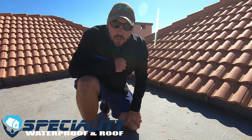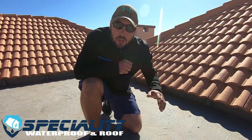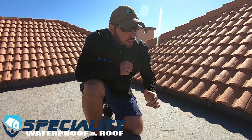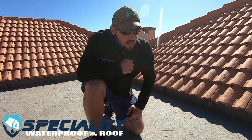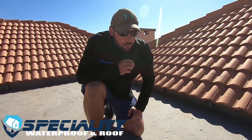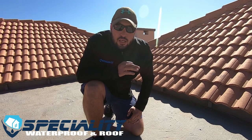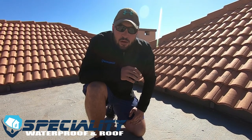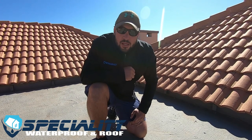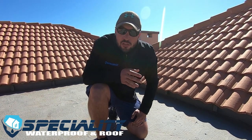The customer has already had to repaint after this system was applied. Now we're going to be doing a torch-on system on this. We're going to clean the surface, apply a primer for adhesion and cohesion purposes, then torch a formal membrane system on this and apply a silver coating to reflect UVA and UVB rays. The system is protected for at least three years maintenance-free, but the product is guaranteed for 10 years. After three years they'll apply a maintenance coating, so this system should last anywhere from 10 to 13 years.